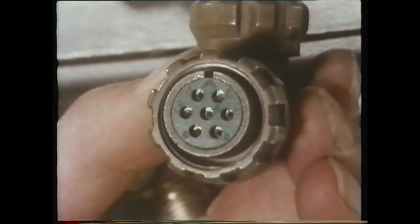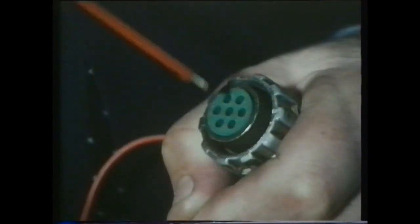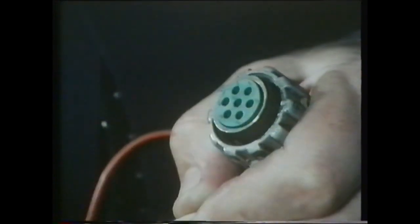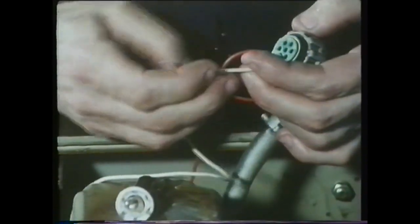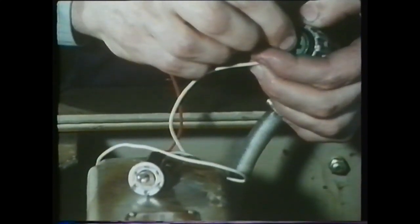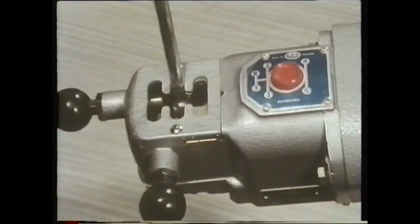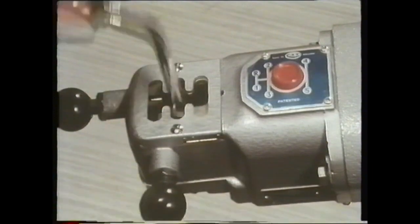The plug has a location channel, and each socket hole has an identification letter. Here is the location channel of the plug. The central hole is the neutral. This is the first gear socket, and this is the second gear supply socket. To determine whether there is an electrical supply from the change speed unit to this plug, use a test lamp fitted with a bulb that will consume no more than 0.7 of an amp. Place one lead of the test lamp in the second gear socket and the other in the neutral socket. Now apply second gear intermittently. If there's power from the change speed unit to the EP plug and to the second gear socket, the bulb will light — in some change speed selectors only momentarily, because the circuitry of some change speed units is set to cut out on either underload or overload.